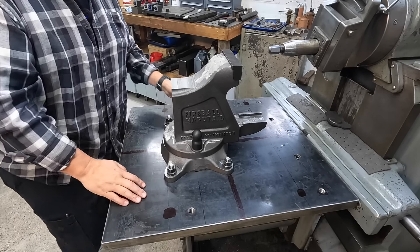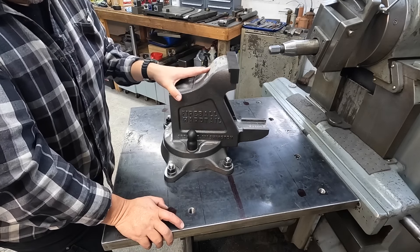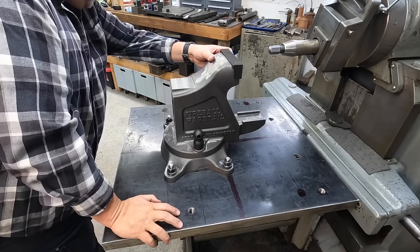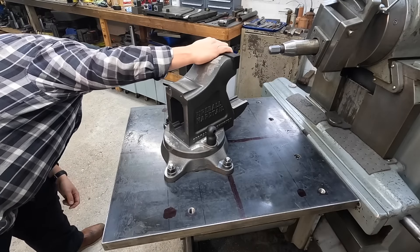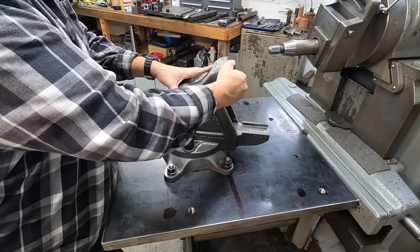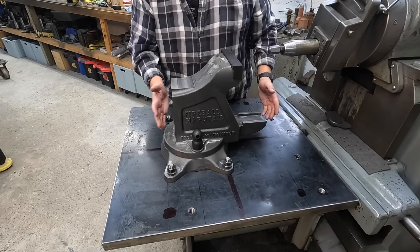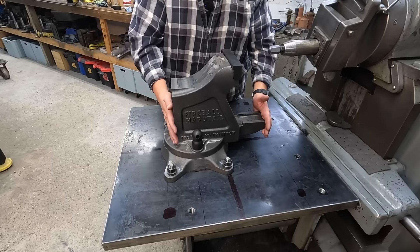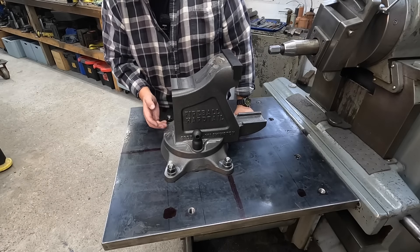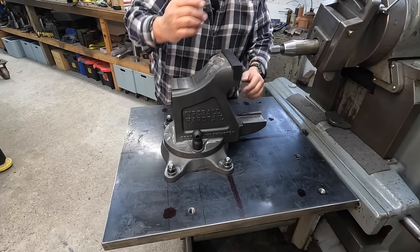Always something, isn't it. The studs are just a little bit too tall to be able to pivot the assembly all the way around. It looks like it'll just barely clear all of the flange nuts. So I need to take all these studs down to the height of the flange nuts so that we can pivot this around. What I was planning was to cut this side first - since the bar won't go from this side to this side - get it to the right height, then rotate 180 degrees, get it indicated, and go from this face to this corner cutting the inside of the body. I'll modify these studs so we can pivot when we need to rotate it.